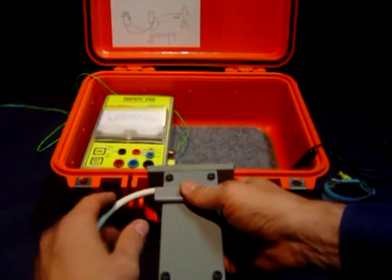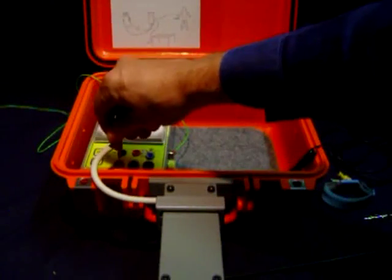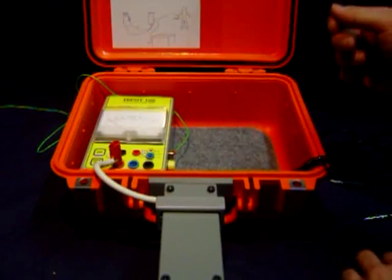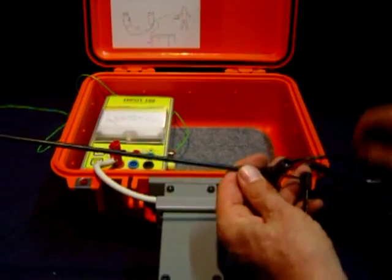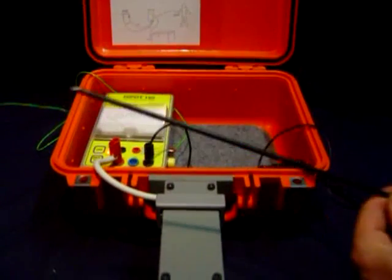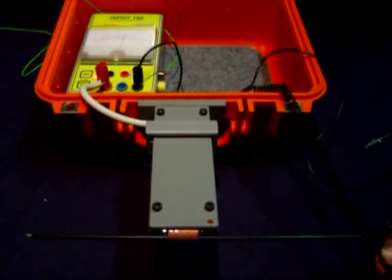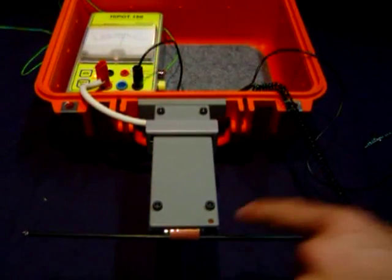To connect the wrap electrode, push the wrap electrode into the dovetail and connect it to whichever of the two active voltages you require: red for monopolar, blue for bipolar. Connect the wrist strap and connect the instrument you're testing to the common return. Make sure the unit's on and test it, making sure it buzzes. As you see a breakdown you'll hear it, you'll see a light, and you'll see the meter deflect.